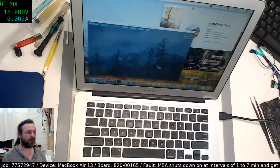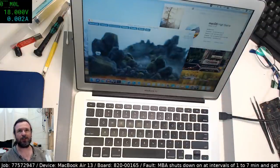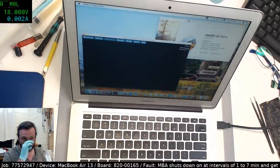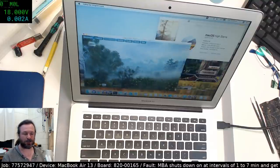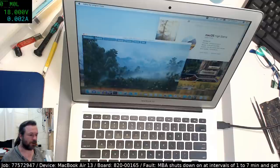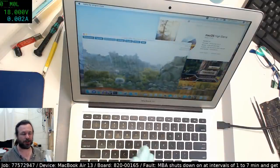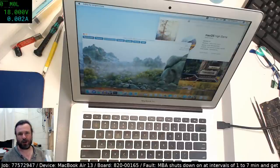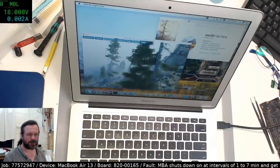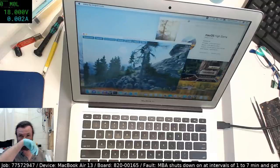All right, well, I think that's good. We're dropping down on our battery here. Damn you, focus. But that's down to 99. Now, as far as I understand, you basically have to wait till it gets to 95, else it's not going to charge. You can plug in the MagSafe anywhere between 95 and 100, but the system won't charge when it's in that 5% gap. It's just to prevent it from thrashing the battery too much. Oops, scratch the nose.